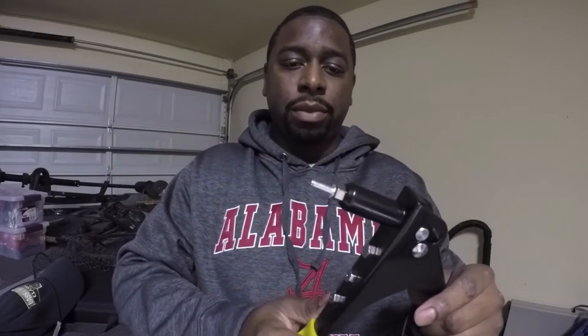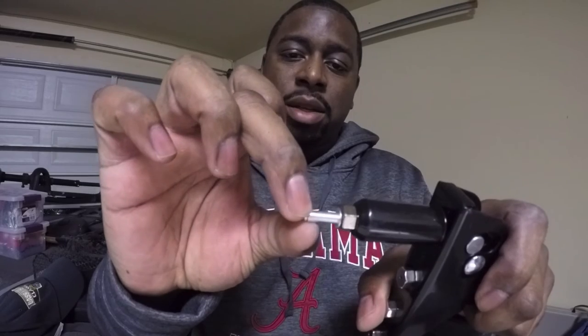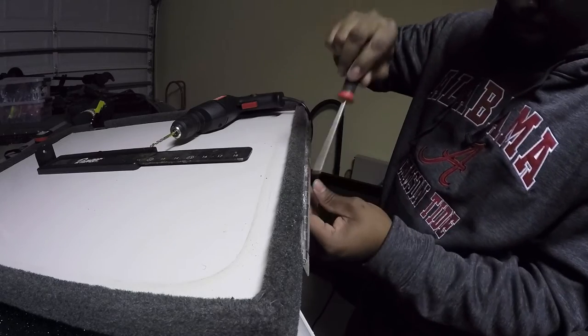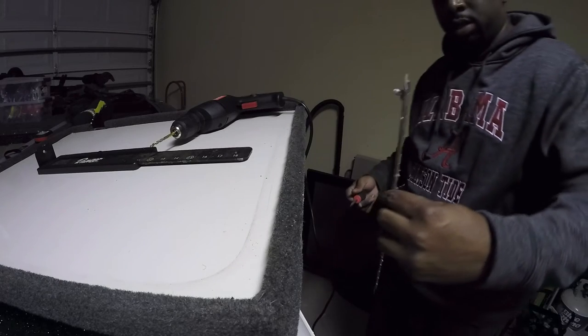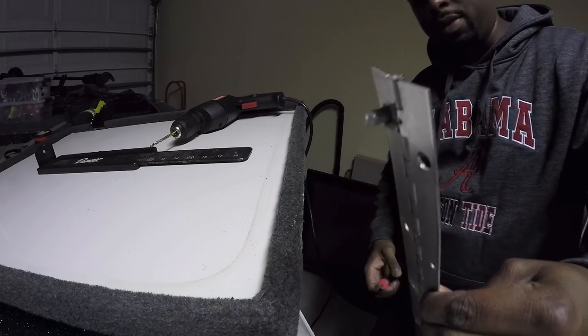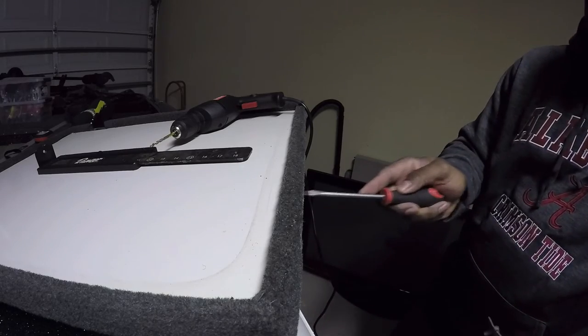For those who don't know how to use the rivet tool: take one of your rivets, put it in here like that, stick it in your hole. The tool, as you squeeze the handle, is going to pull the pin in the opposite direction of the hole until the little ball expands inside the collar. Then once it gets to the end it's going to clip it off and you'll just be left with the rivet itself. That little end cap nub goes inside the collar and that's what secures it.